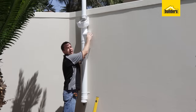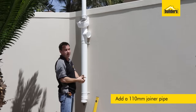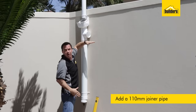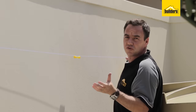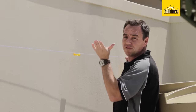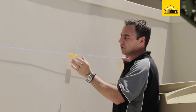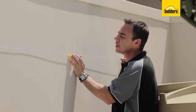From here we're going to mount up our 110 pipe taking us all the way to the tank. I'm going to make use of a chalk snap to make sure I get a straight line, also with a slight gradient so the water does flow down towards the tank. I'm making use of a chalk line to get my pipe level and then I'm going to pull it down slightly and give it a slight fall. We've got a little spirit level here — we can just check to make sure it's level, then bring it down a slight gradient.